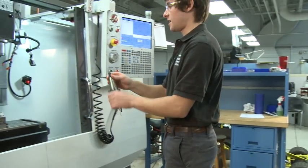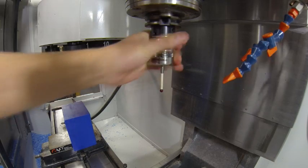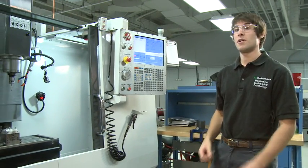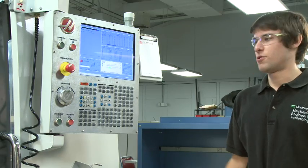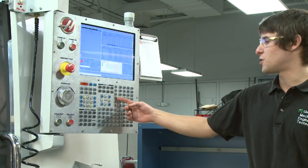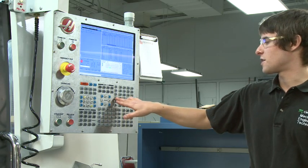I'm going to put the probe back in. When you're inserting a tool — especially the probe back in the machine — you want to make sure you put it in the same way you got it out. They are supposed to be symmetrical, but it's always good to be safe. Before we actually probe our block, just a quick review of jogging. You can jog from the hand jog mode or from the IPS, but let's do a little hand jog here.